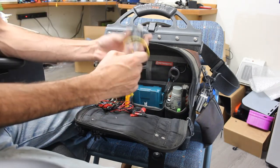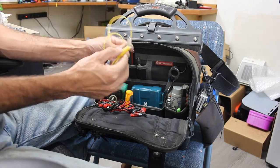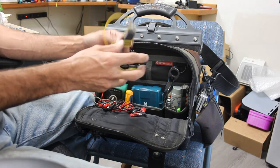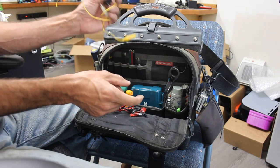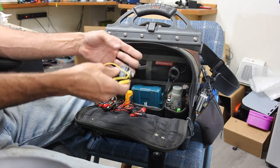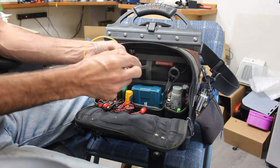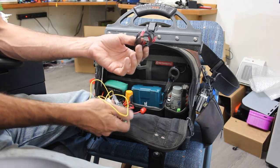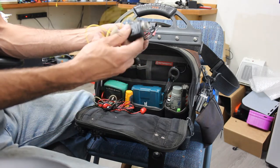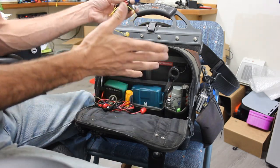I keep a mini circuit breaker — a 5-amp — and right now I have alligator clips on it for troubleshooting control transformers. If you're having a short and blowing control transformer fuses, this is really handy to put in place of the regular fuse so that you can troubleshoot without going through 15 fuses to find a shorted switch or something like that. I also have small connectors I can swap the alligator clips out with, so if I'm dealing with an automotive fuse or a control board for an air conditioner it's good to have a circuit breaker rather than a fuse. Versatility is what this bag is aimed for.